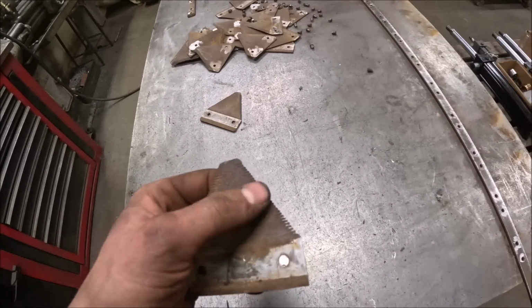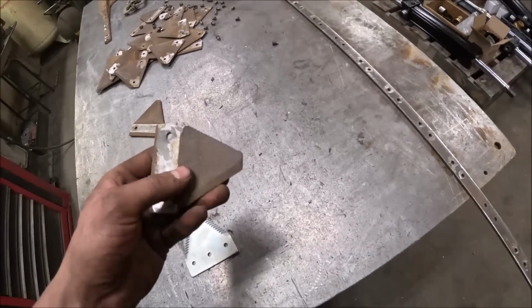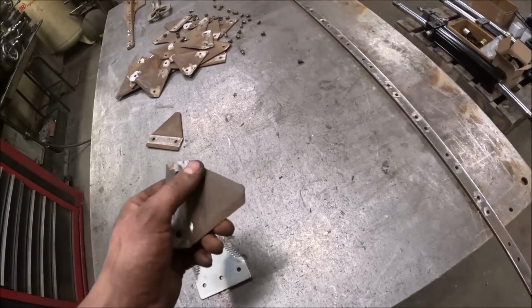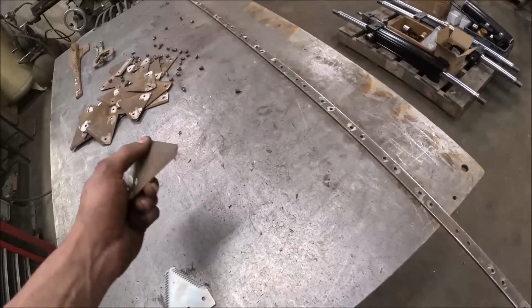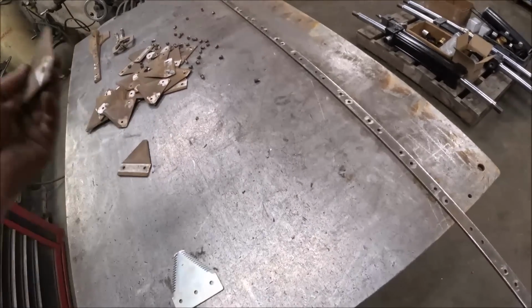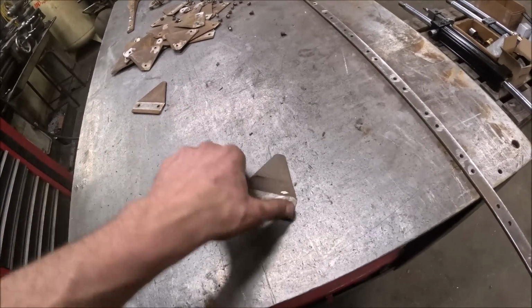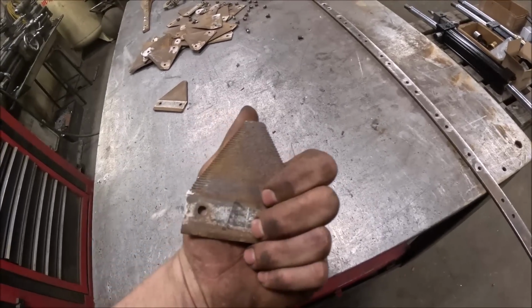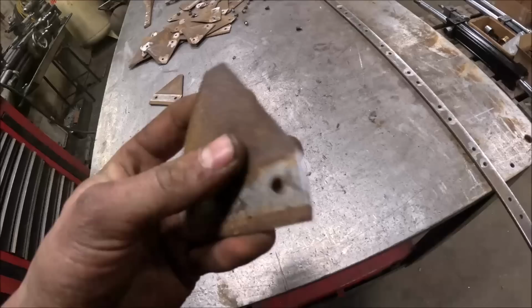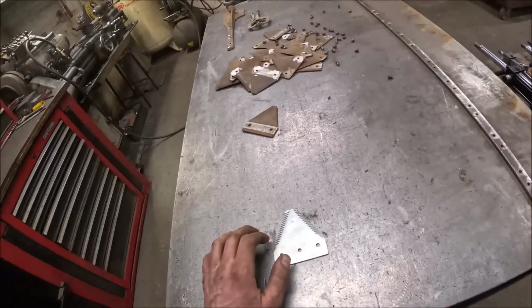The whole intent of the bottom serration is that these are supposed to be sharpenable. Back in the day when sickle type mowers were common with rivet-on sections like this, there was actually a sickle sharpener. You would pull the bar out of the mower, and some versions you actually clamped on the bar and could sharpen on the mower, but more often than not they were bench mount or stump mount, or whatever farmer style they had going on. You'd run the bar through it, and it had a grinding wheel meant to put the profile back on the sections. The under serration is there because as you sharpen, it basically re-serrates itself, because you'd eat back into the serrations and expose them again. You could sharpen them all the way up until about there where the serrations disappear, and at that point you'd take them off and throw them away.